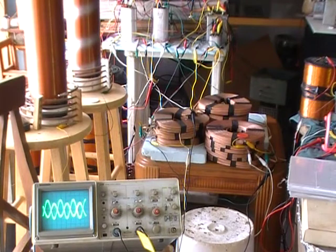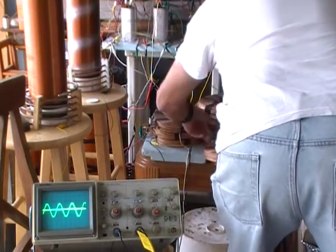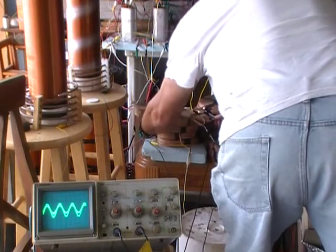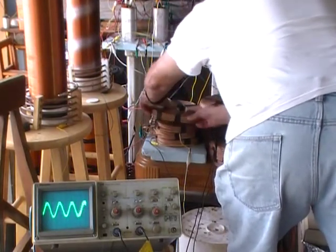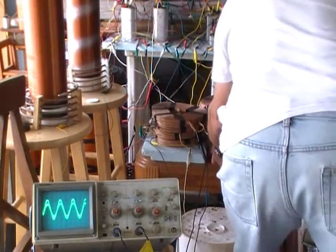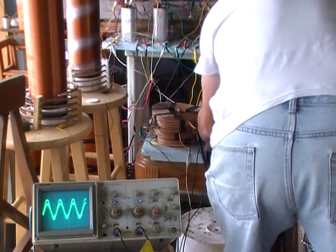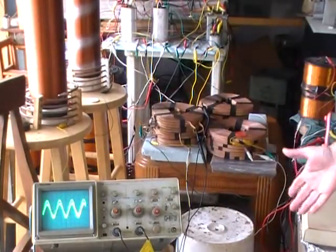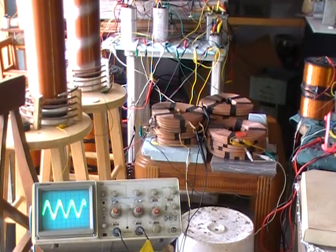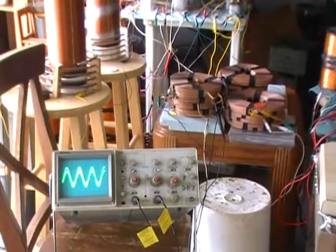We shall then go and take the bottom coil out of phase 3 stack and place it on top of phase 1 to record that observation. And as we can see, those fields are identical. And so what we can conclude here is what we just showed, the phenomenon of three opposites in time.